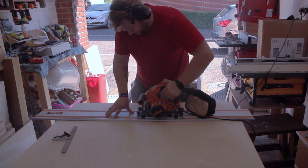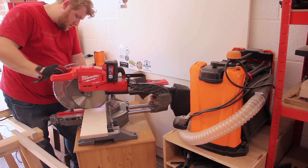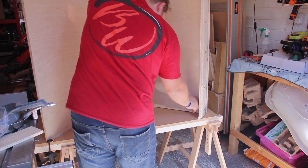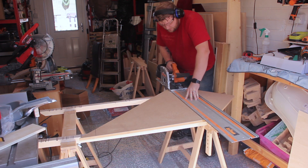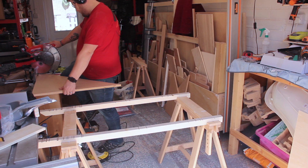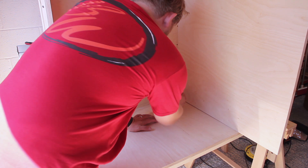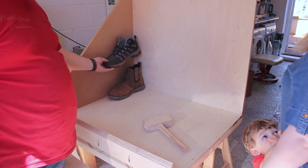For the actual sides of the shoe rack, I started with the front sections. I did run out of plywood, so I ended up having to use MDF for the big section at the back, but it's all 18mm and secured with pocket holes. For the sides, I thought it'd be easier to put the whole thing on its side on the plywood and MDF and just draw around it — that gives me the exact size needed for the panels. I then used my Triton track saw to cut it all out, then pocket holes again to attach the sides.